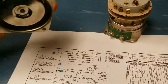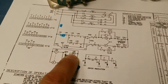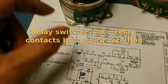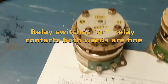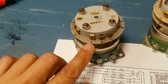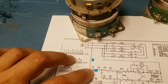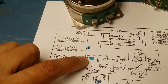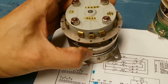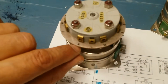A quick recap: these are the coils — they're what actually activate the relay. On a schematic, coils always appear round, and the switches associated with that relay are connected to the normally open contacts. If it were a relay like these, you'd have letters across the contacts — for example, A and B, or D and F, which is normally open, or G and H, or K and L — to indicate which contacts are normally open or normally closed.